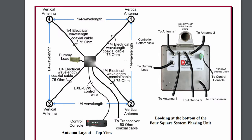There's been a good bit of reading required to understand this. Roley and I talked a while back and he came up with a pretty good design for a four-square. The commercial four-square control boxes are pretty elaborate. Most of them use what's called a hybrid coupler — a series of transformers — and another transformer that gives you 180 degrees of phasing. DX Engineering has their own version, Comtech has a version too.